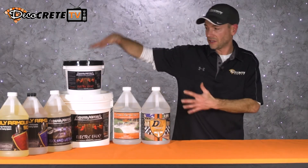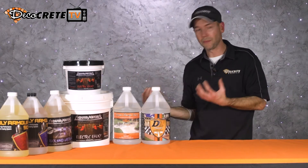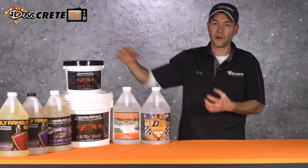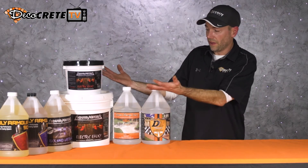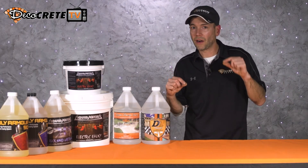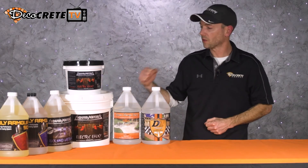Coatings are way less breathable, which means they're very intolerant of moisture. If we get a buildup of moisture underneath the slab, it's going to hit this coating, and if that vapor pressure gets too great, it's going to cause the coating to fail and pop off. One of the other great things about a coating that dense from a two-part product is that we're not going to be able to melt into it — it creates a really hard, durable coating. That's why we love it for top coats on metallic epoxy, chip broadcast floors, and really durable flooring systems.